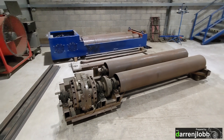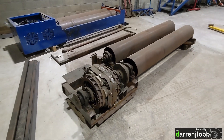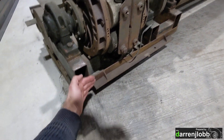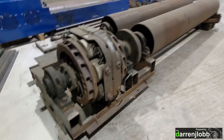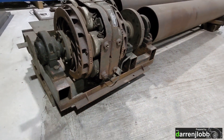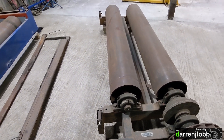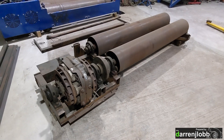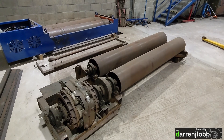I'll probably live to regret that because it was awesome having it sunk in the ground. Anyway, first things first - we're going to start building the chassis or frame around the bottom of this. I've already sectioned out the corners on the original frame. What we've basically got to do first is extend these original boxes out flush so we can run our new frame rail - right along the front, right along the back, with the existing sides. We've got some box section here, same as used on the other one, to extend that out. Only the front needs extending; the back already has enough clearance behind the roller.